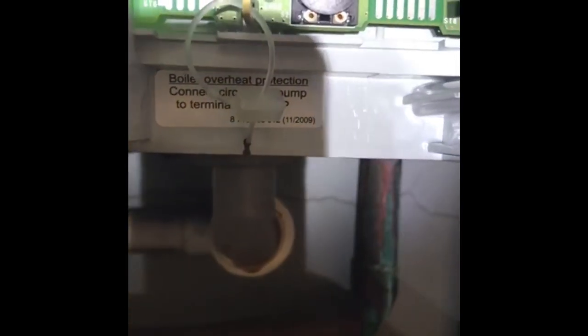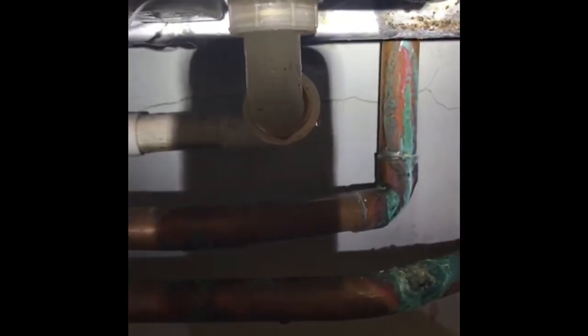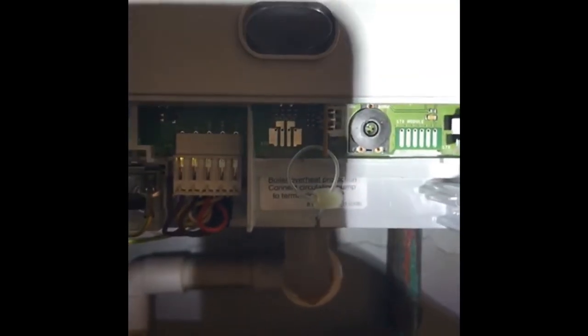Just to show the lads who don't know about this - well worth knowing. You take the cover off the RI - that's the electrical cover. You find a little peg in there and that peg slots into this potentiometer just there. The potentiometer all the way to the right is normal operation. One turn left will be maximum service mode, and then another turn left is minimum service mode. Well worth checking. It's very hard to service - don't jam a screwdriver in there if the peg is missing; you want to try and get something plastic to turn it to get your service mode. You'll get your indicator light flashing a certain series of lights to tell you it's in servicing mode. Make sure you don't leave it in servicing mode when you put it back together.